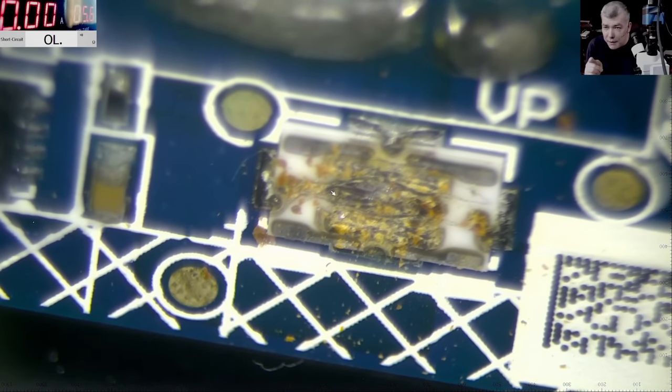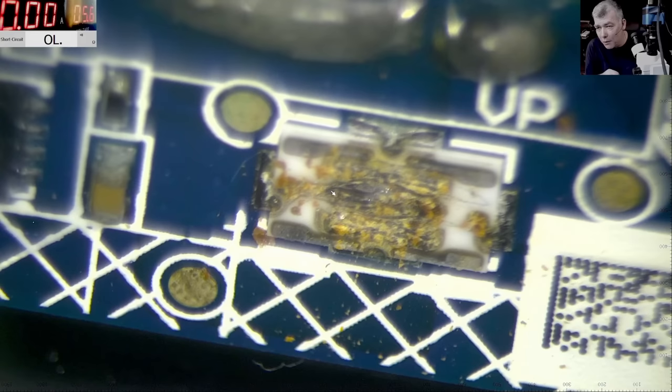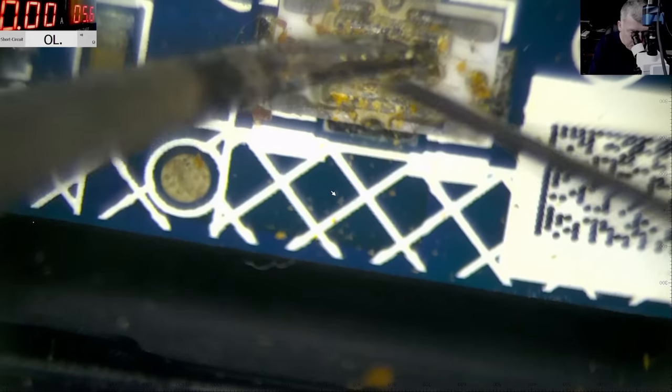Now, I made a few videos about this, and people say here must be a properly calibrated fuse, like a wire. No. If you melt solder and you just make a bubble of solder, the heater will melt the solder. So you're 100% sure that the heater will melt any kind of solder you put there. Actually, the original fuse is the same, with solder. This fuse is not with wire, it's with solder.